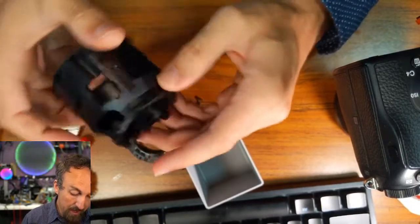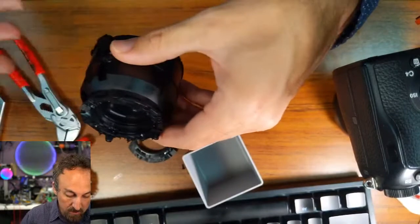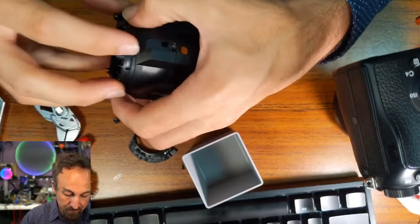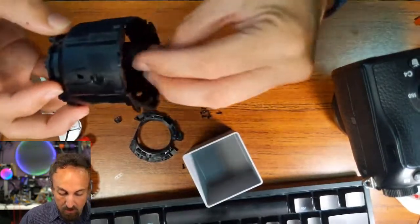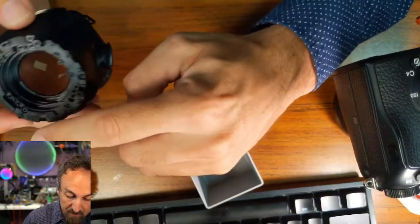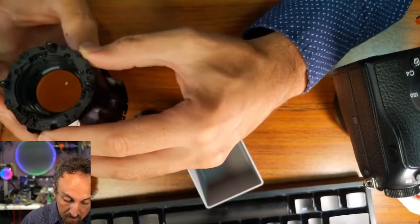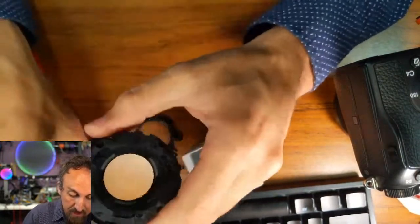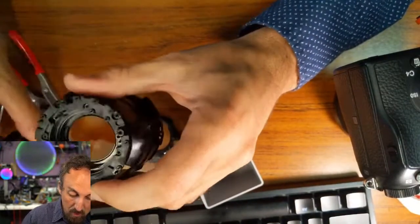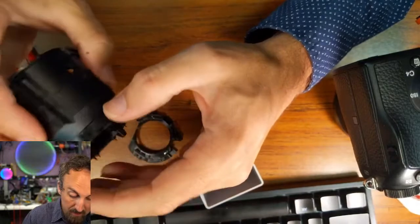And I was just kind of blown away. This ring is undercut all the way around. That basically means the whole shell must have come together from multiple parts, mated with the back of the shell mold here. Obviously, the core comes in. It's wild. All these little pins are locator pins for rubber isolators for the circuit board that drives the ultrasonic motors, and alignment pins for the lens element that drops down in here. I just wanted to share that; it really surprised me that there's that many features.